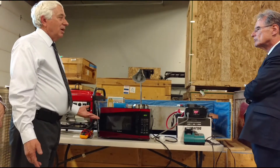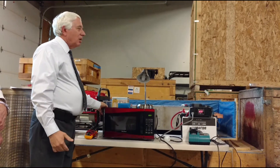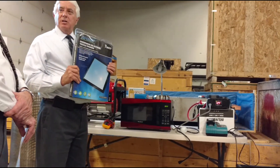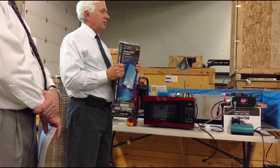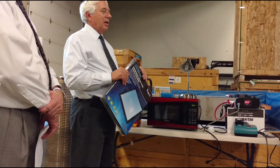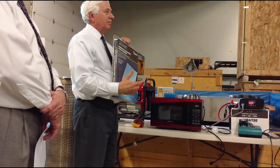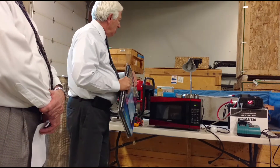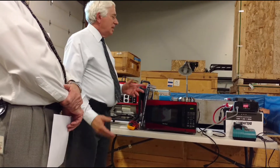The question is, you've got to charge your battery. So you've got to manage - if you're babying it, trying to use just 10% of your load every day. Well, in Colorado we have more sun days than any other state, so we're back to having some kind of trickle charger on your battery system. This little solar charger is only 7 watts, but that's too little. You could figure out how many hours off a solar charger would restore your battery. That changes what wattage you need from a solar panel. A 40-dollar unit is too small; what you probably need is more like 80 to 100 dollars, which would probably charge your batteries every day and keep a perpetual motion type thing going.